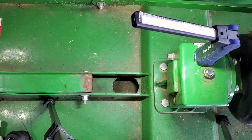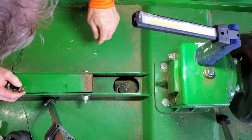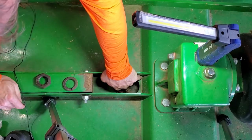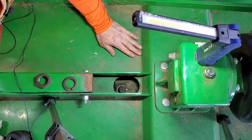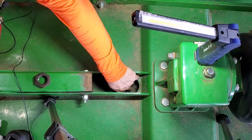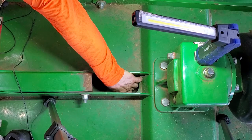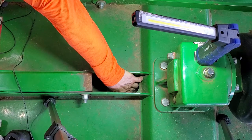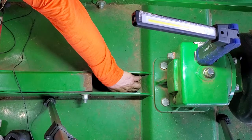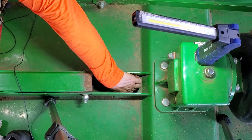So now I'm up top and I'm going to try to put this nut on. This is one reason I wanted to leave that shaft off — see how easy this is to turn. I can basically reach down in here and just kind of move it around with my hand. If you have the PTO shaft on and attached, it's much more difficult to move this around. I'm going to put the lock washer on first and then the nut that goes on next. I have read in some forums that people recommend you replace the bolt and the nut when you replace the blade. I do have a new set, but these look okay so I'm going to reuse them and keep the new ones as extras.